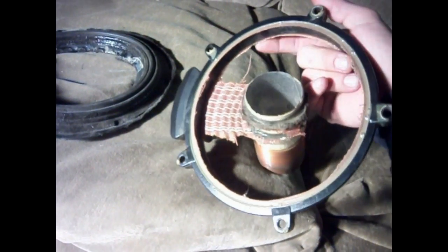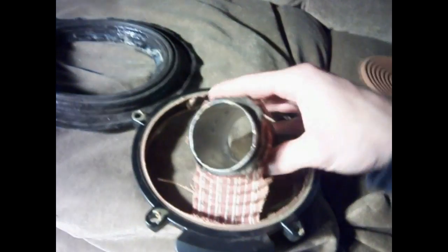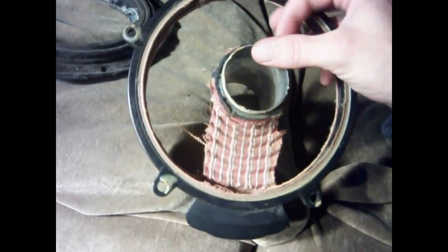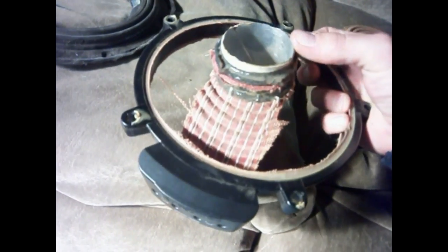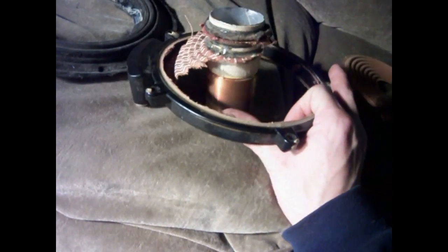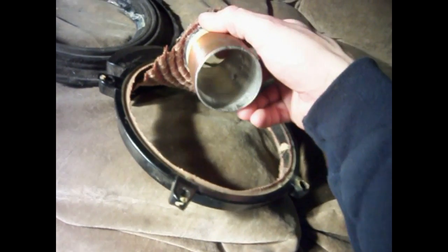Okay, so this is the coil assembly and spider pack out of it. The spiders have been cut out, but as you can tell, this is still connected, and this is where the lead wires are, and this is where I see the major design flaw. There's normally two spiders in here, and when this coil is going up and down, it ends up being stiffer here because of these lead wires that run through all on one side like that. So what ends up happening is your coil ends up starting to rock after a while, because it's held stronger there than it would be on the other side. And they don't have anything to make up for it, so it ends up rocking really bad, and you end up getting the wear on each side.